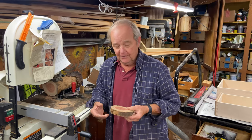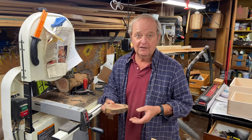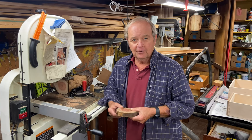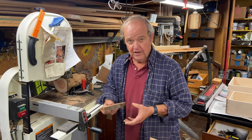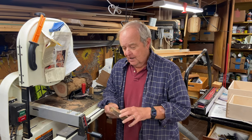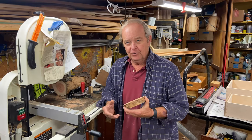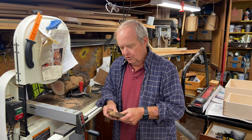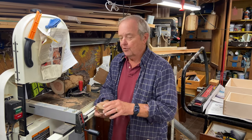The reason we go to all this trouble of drying and doing it in a homemade kiln is to prevent these wood slices from cracking, because that's a very real danger. When you cut them yourself, you really need to dry them and get all the moisture out. Moisture will come and go, and that can move the wood and cause it to crack, so it's very important that you dry them.